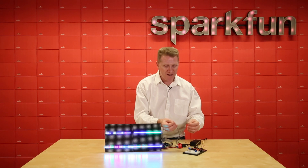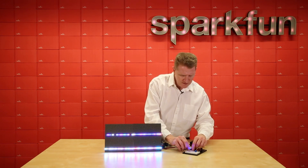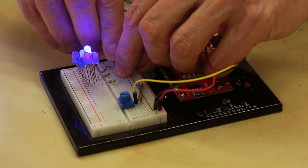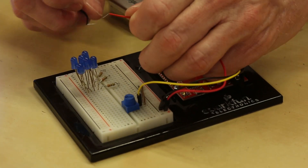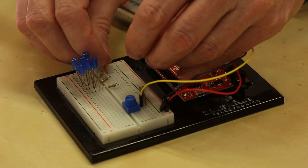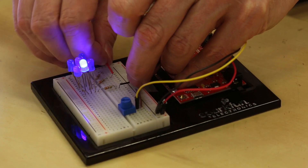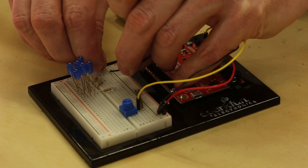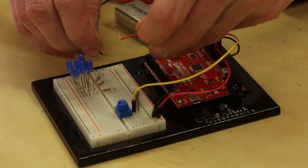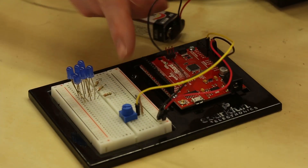For ease and simplicity, I've just got a nine volt battery and resistors so I don't blow up my LEDs. If we go high on pin one, low on pin two, we've got our first LED illuminated. Switch them over so pin two is high, pin three is low, and pin one is inactive — we get our second LED illuminated. And as we know, we switch these around: two goes high, one goes low — we get that one, and so on and so forth. There's that one, we go out to one and three, reverse that on one and three. And there we go — that's six LEDs from three pins.